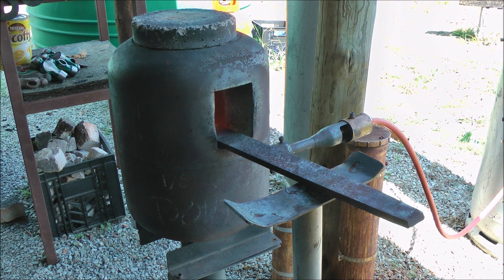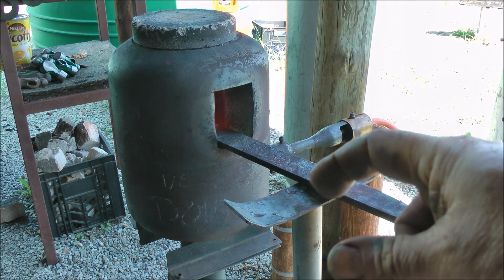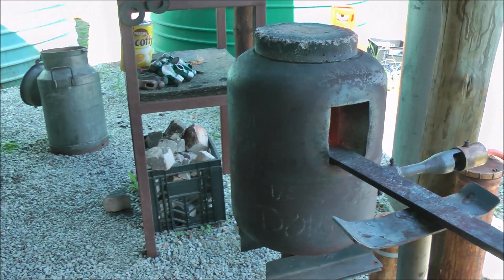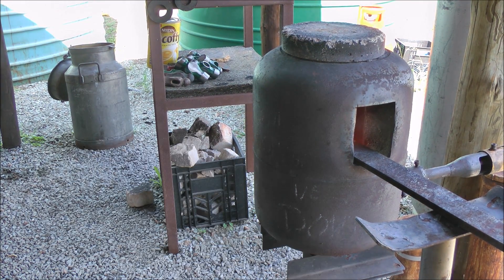Well, of course you can. Can it be hardened? That is the real question. But if you don't know what steel you've got — even in the form of a file like I have here — I'm going to stick it into the forge, heat the tang piece up, get that thing yellow hot, and then stick it into that bucket of water standing there. Just plain water, nothing fancy. We want to get this thing as hot as possible, cool it down as quick as possible — in other words, make it as brittle as possible.